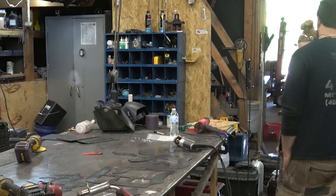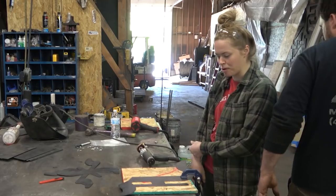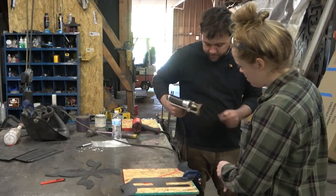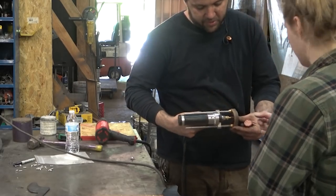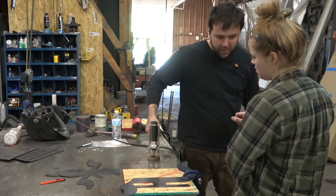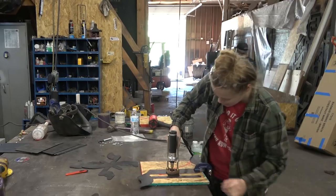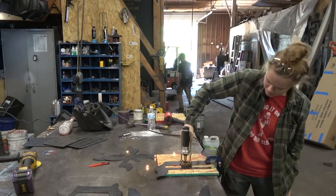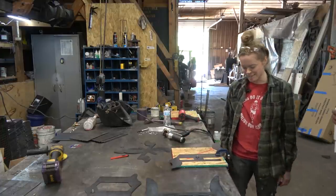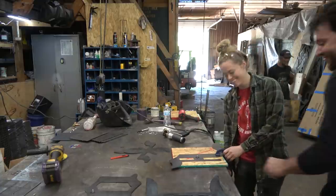It's stud bends before the weld bends. Perpendicular. So this is a little spring loaded. You feel this? Once there's a stud in there, see this is spring loaded? And so you just push it down flat and you literally just pop the trigger. First stud weld ever on a production part. That's rad. It does its thing. It's so nice when things do their thing.